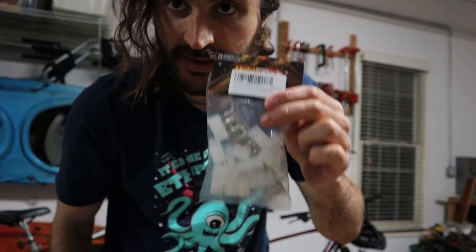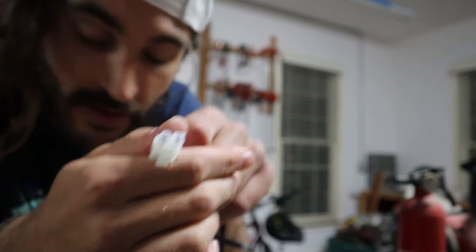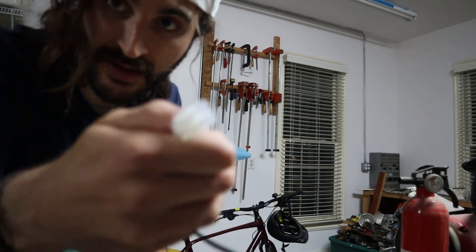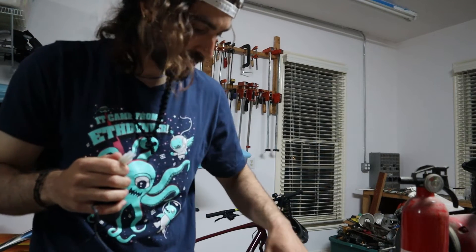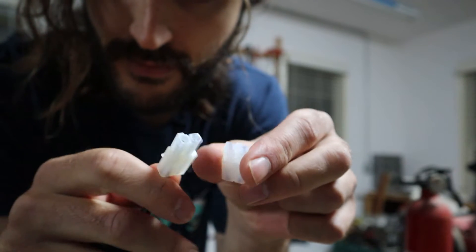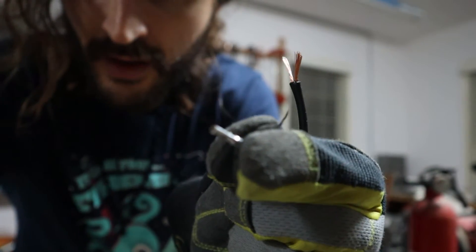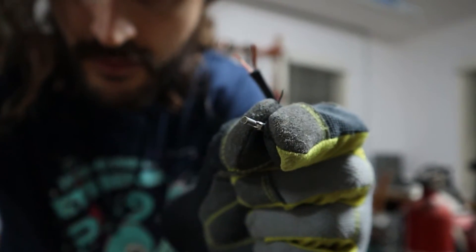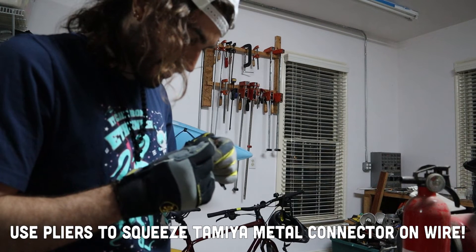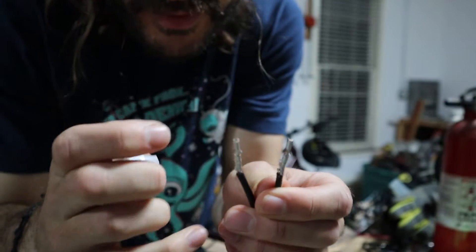We're connecting these clips to the cord. These connectors are male and female. The charger for the battery and the power cord need to have the same exact clip. This is a male, so we're going to find the male from the bag. These metal Tamiya clips have to go on the wire like this — you put it through and you solder it. Make sure all the wires are inside because you don't want to electrocute yourself.